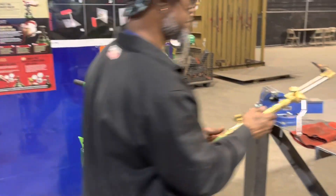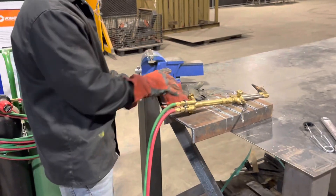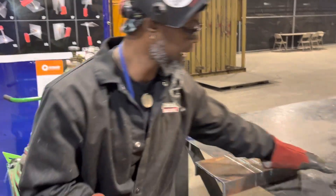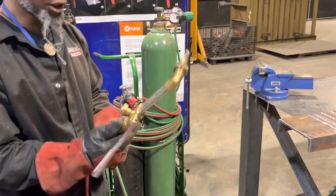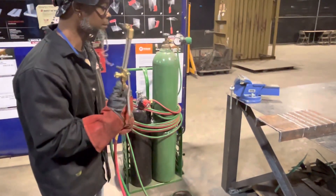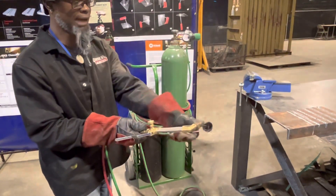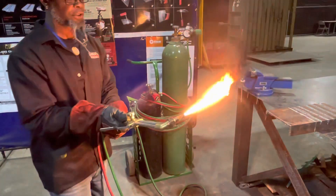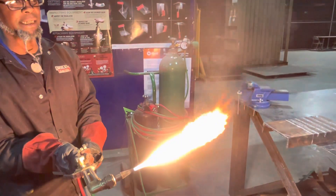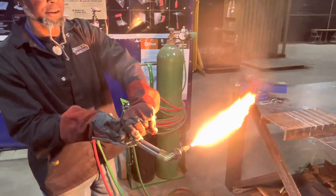When you get ready to put the gas on, make sure you've got your gloves on and your proper PPE — you want to have everything you need to keep from hurting yourself. When you cut your gas on, you don't want to hit the oxygen yet, just cut the fuel gas flow on. Normally it takes a second — once you can smell it coming out, you're good. You won't need it all the way up. You'll see black smoke if you don't have enough fuel gas, so adjust until the smoke reduces, then start hitting your mixing chamber.